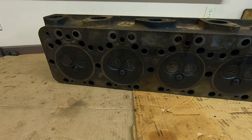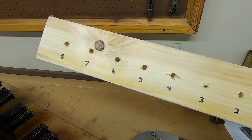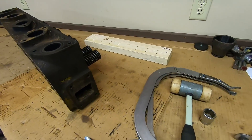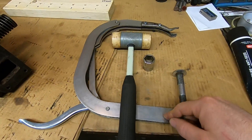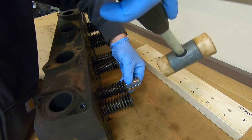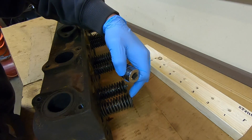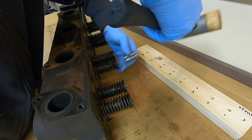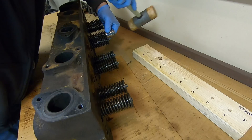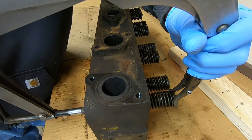Let's work on getting the valves out of 2115's old head. This is going to be a trip down memory lane — I had those out and refreshed them about 20 years ago. I've got my board ready with 3/8-diameter holes drilled in it that fit those valve stems, and they're numbered so I can keep track of which spot they came out of. The tools I'll need are a valve spring compressor, a soft-faced hammer, and a socket. First I'll tap on the retainers with the hammer and socket — those keepers have a taper and can wedge in pretty tight, so this loosens that wedging action and makes it easier for the valve spring compressor to work.